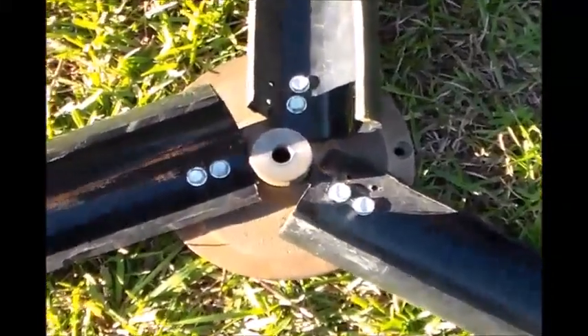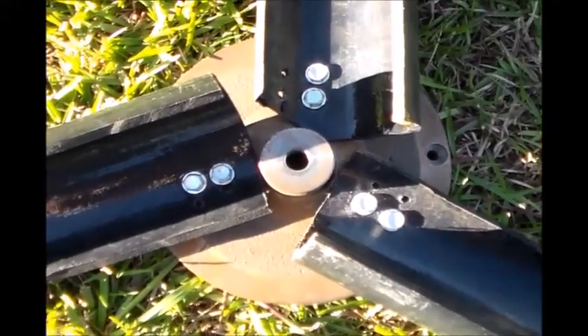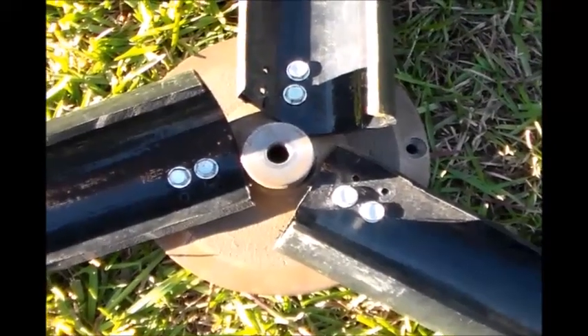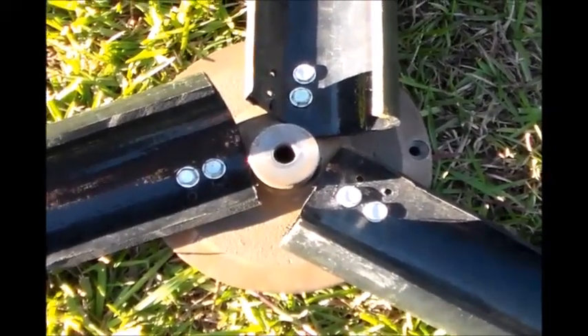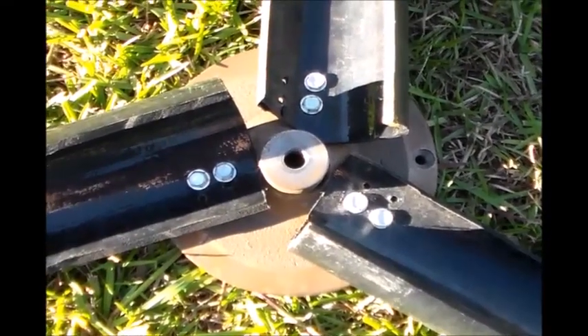The flywheel hopefully won't give me any problems, but my treadmill motor is a clockwise rotation motor, and this flywheel here has left-handed threads, which means if you turn it to the right it's actually going to loosen.